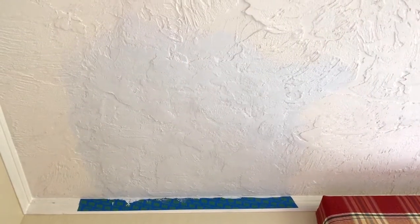I primed the ceiling patch. Next, I'm going to apply ceiling paint that's custom colored to match at least approximately the existing paint. I'm going to feather and overlap it a little bit here — that will help blend in the old with the new.